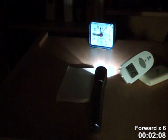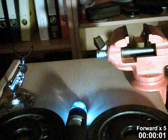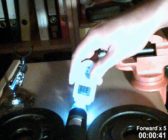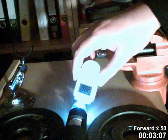The measurement reveals that the reflector can easily heat up by 13 degrees Celsius. Now, the reflector is made of plastic. Plastic is a bad heat conductor, but it does expand under heat. By the help of a microscope camera, I tested how far the reflector expands and contracts. I just heated it up with a hairdryer and then took pictures of it during the cool-down process.